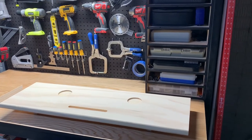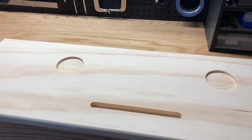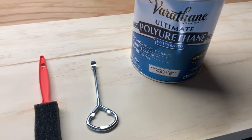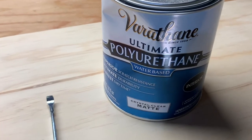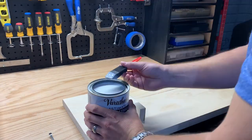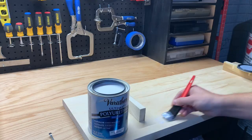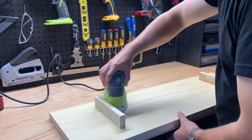I sanded the tray with 220-grit sandpaper on all sides for a super smooth finish, as well as filled and sanded the holes for the legs, which isn't necessary as they are hidden underneath. The tray should stay pretty dry for the most part, but I wanted to protect it. I used Varathane water-based polyurethane in a matte finish and used a foam applicator to apply it — the thought process was to keep the original look as much as possible. It will appear to go on milky white but it will dry clear. I applied three coats and sanded between each coat with 220-grit sandpaper.